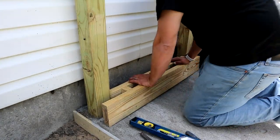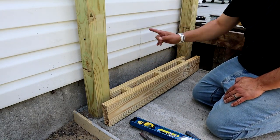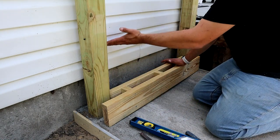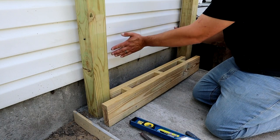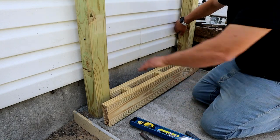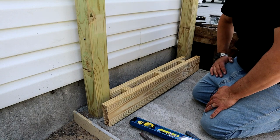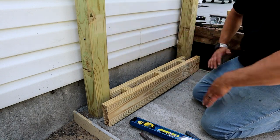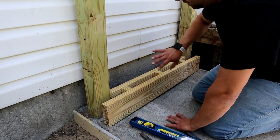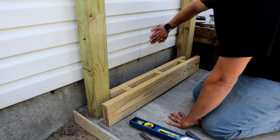We're going to be running the joists out this way because the deck boards are going to sit in here. Normally I'd mount a pseudo rim joist on the outside here and run my joists into that with hangers, but with these posts up against the house I'm not going to be able to get that rim joist in place. Normally when you're building a deck up against the house you put a ledger board on here, cut the siding away, and the ledger board gets attached to the framing of the house - but I don't want this thing attached to the house, I want it to be freestanding.